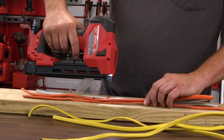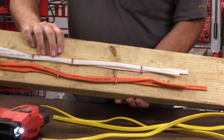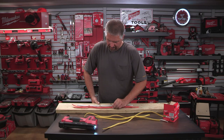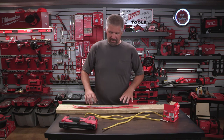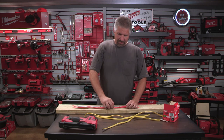It can staple up to two sets of 10/2 wire, which is really nice. But see — I shot through and it bent the staple because it hit the side of a knot in the wood. That's something to watch for: in denser wood this staple is not gonna get in there well and you'll end up with a bent staple.